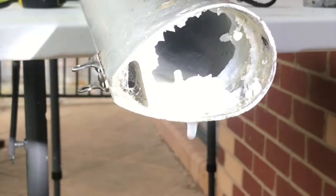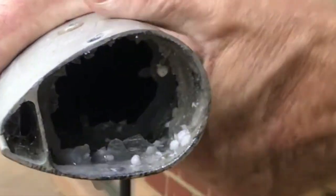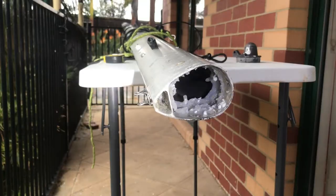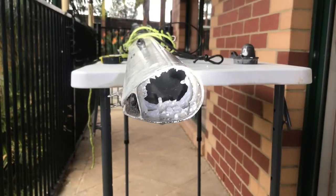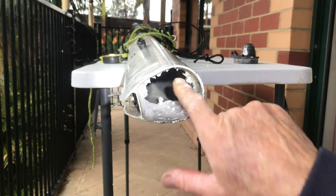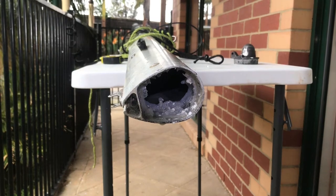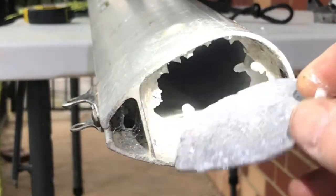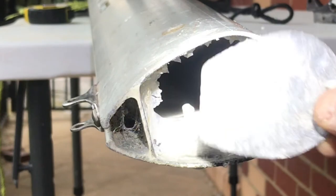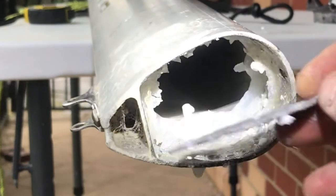Got this plate out and there's quite a bit of water coming out of this mast — quite a bit of water up the guts there. So we're going to at least reseal it and put a plug further up above the mast spanner position so it'll be sealed above the mast spanner. This old mast had a piece of aluminium cut to size and sealed with silicon, but it hasn't been holding over the years — the silicon's shrunk and dried off and it's been leaking.